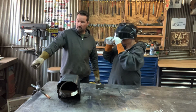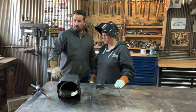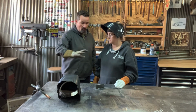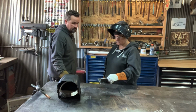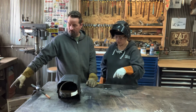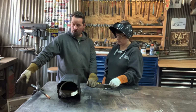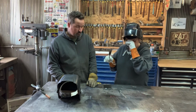So you wanna turn the heat all the way up, and then you got the welder on like 3.5. You turn on the gas. You got your helmet set up where you like it. Say I wanted to weld something thinner, I gotta turn it back up? If you want to weld something thinner, you're gonna have to turn the heat down, and you might even want to mess around with the wire speed to turn the wire down.